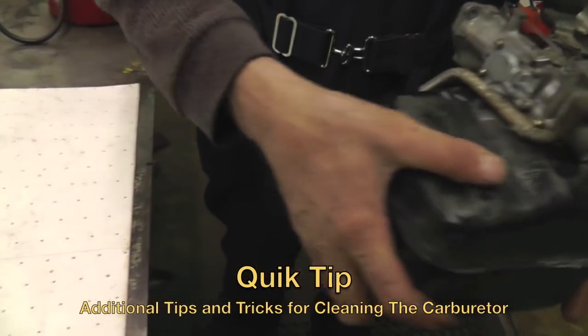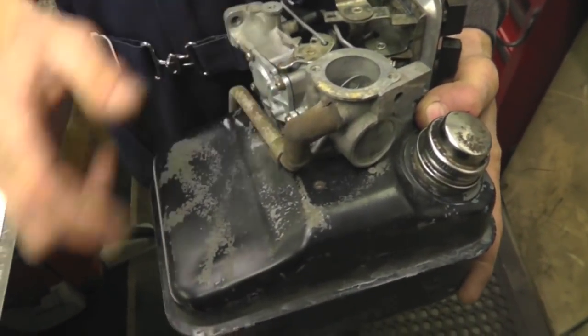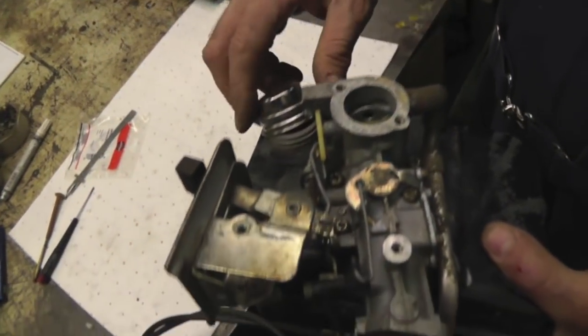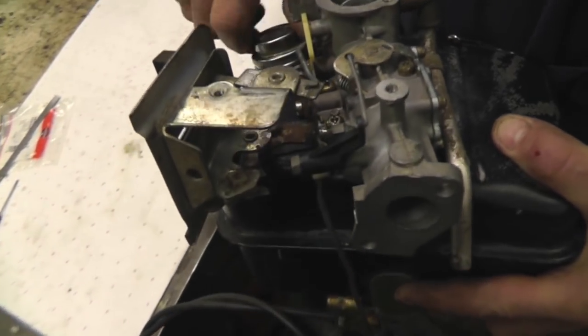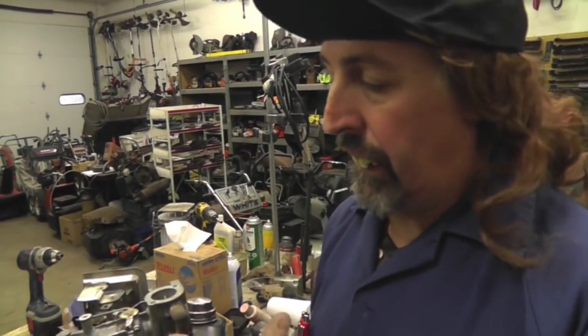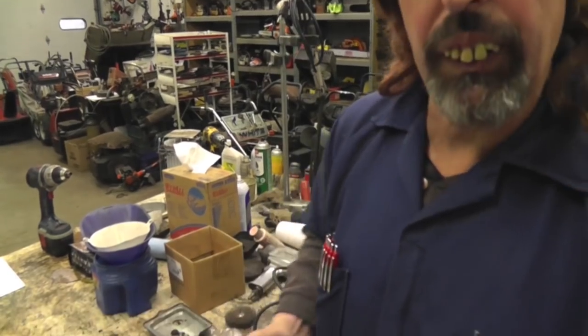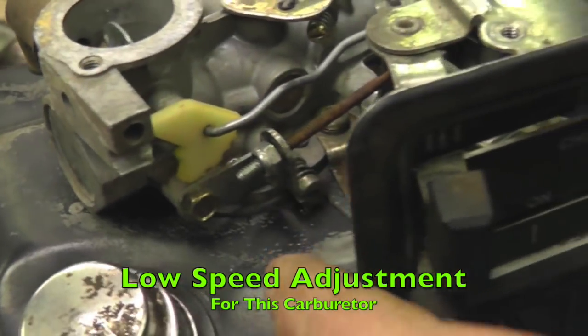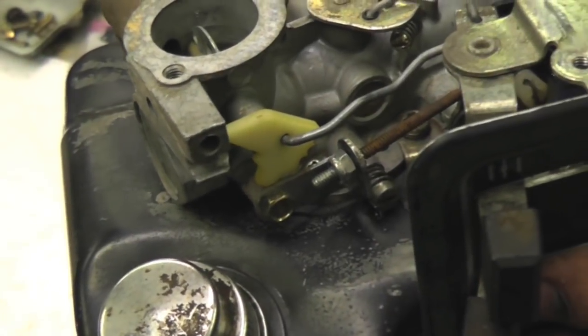And there's your dinner — okay, here it is, all back together. New pump, new tank gasket, new diaphragm, new tube, new pickup tube. It should be ready to go. Now, these gas tank carburetors set up like this — Briggs and Stratton has been making them forever. This is the newer version. The older version works just about the same way, it just has an adjustment over here — a high speed adjustment. This is a low speed adjustment on this one. So make sure that's clear too when you take it apart and clean it.